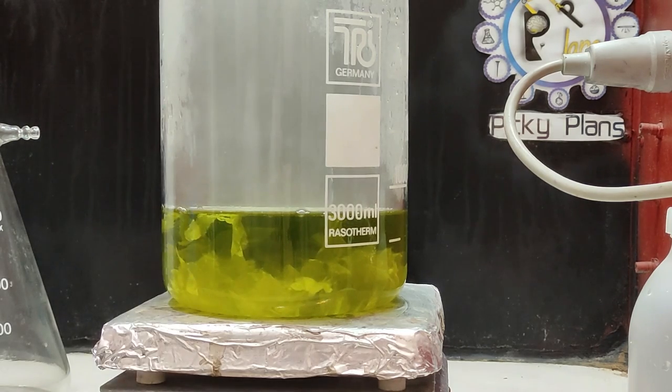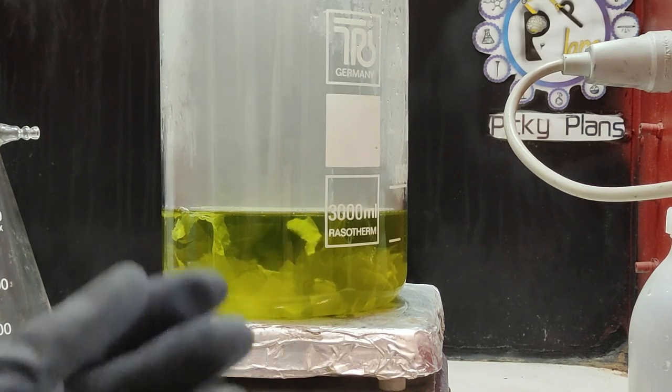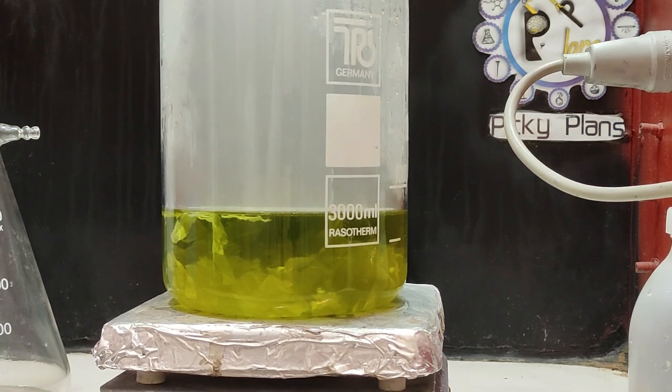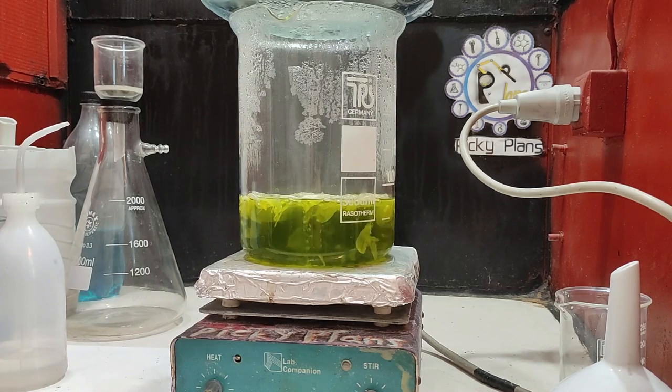As you can see, the turbidity is gone due to heating the solution. Whatever it is, it's dissolved in hot acid. So after boiling a bit, I should let the solution cool down again, and after that I'm allowed to filter the solution. I will leave it here for 1 hour to cool down slowly, just in case to catch all impurities on the filter paper fibers.